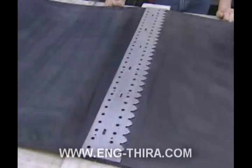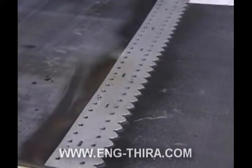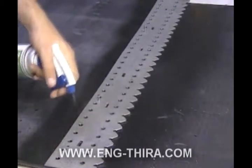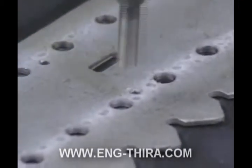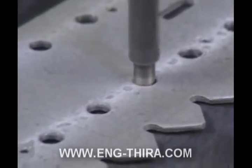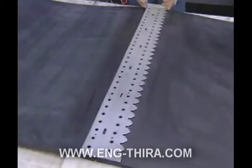With the template in a fixed position, it's time to start punching or boring the holes. Prior to punching or boring the holes, spray the template holes with Flexco silicone lubricant. The lubricant will reduce friction on both the belt surface and the belt punch and simplify belt cutting and hole punching. Punch or bore the holes using the template as your guide. Once the holes are punched, remove the template.